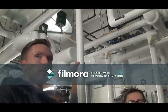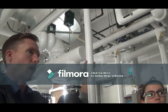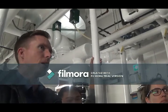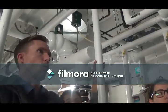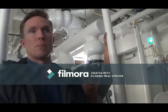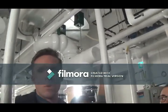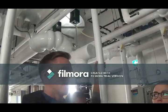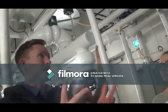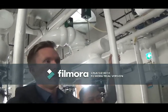It'll either show up yellow, orange, or red. These are color codes to give you a quick idea of what it's trying to tell us. Yellow is a hold code, and a hold code is typically just the boiler waiting for a safety to close. It always happens on startup, and it always shows at shutdown. On startup, there's one safety that needs to close: the air proving switch as the fan ramps up. So you'll see that every time. It's a hold 67 as well. It's technically an alarm, but it is completely normal operation. You'll see it every time the boiler starts up.